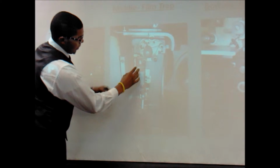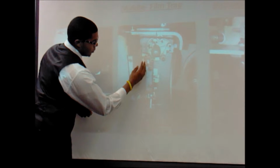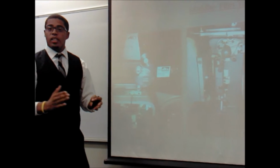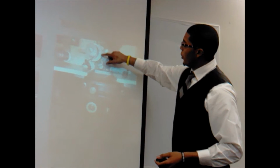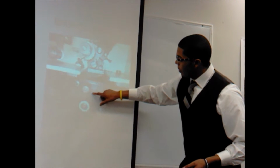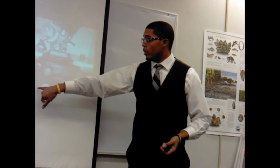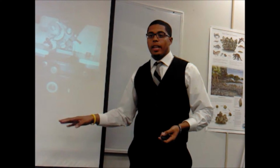Now in this, there are about 4 rings, which we place the movie on, and once we click this silver bar right here, it clamps it shut so the movie can't come off. It holds it tight. Next, we come to the bottom, where again we feed the film through from the bottom up to the top with another loop. Once we feed it through here, we come to the bottom, and if the movie's not in here tight and doesn't have any tension, then the movie will not start. Now, when there is tension, you will see a green light flash on. When the green light flashes on, the movie's all set and ready to play.